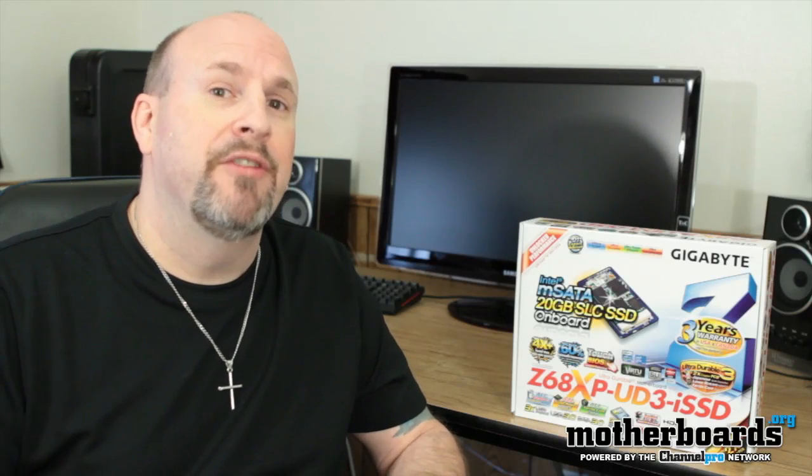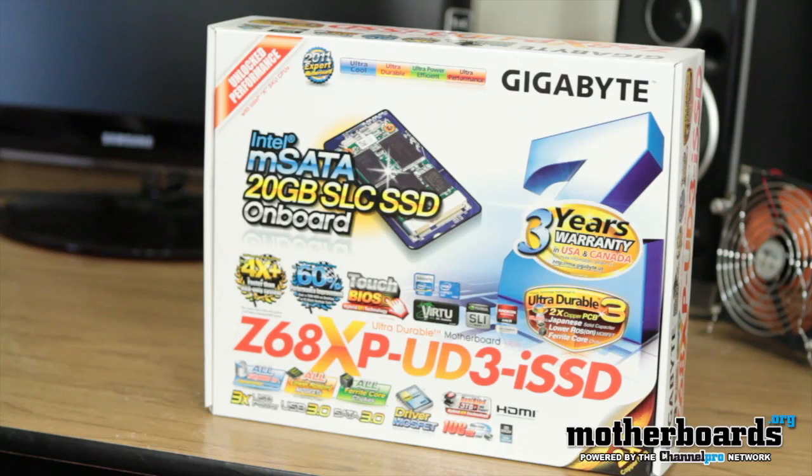Today, we're going to bring you guys the full review of the new Gigabyte Z68XP-UD3-iSSD. Now, what makes this motherboard so special? Well, this motherboard is the first to have Intel's Smart Response technology and integrate a 20 gigabyte SLC SSD right onto the motherboard. So what this does, this actually helps any of your standard hard drives run in a pseudo type RAID array for much better access speeds and faster access times.